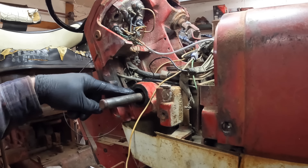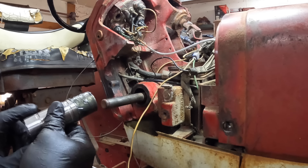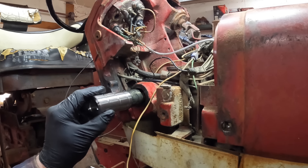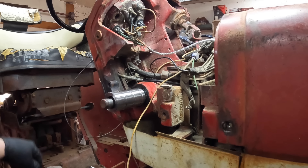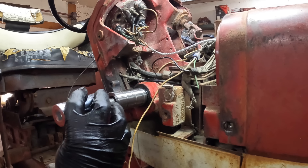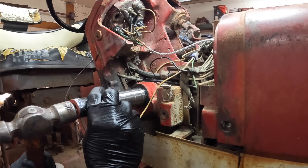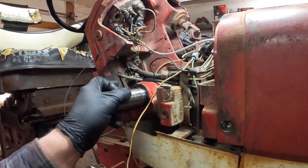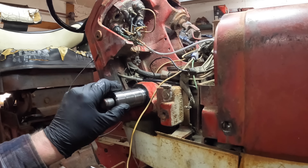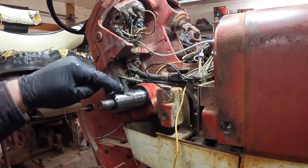Now, there is a replaceable bushing right in here. You can barely see the lip of it, but when I test fit this, it fit nice and tight, so no worries there. In fact, I have to use a little persuasion to send it home. This shouldn't spin — the levers spin on this. This itself doesn't spin; this spins inside this, but this stays fixed. Give this a coating of grease.